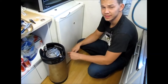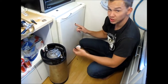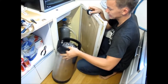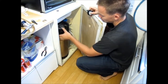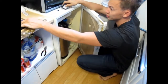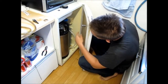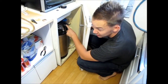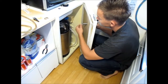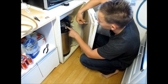Within the door you're going to remove the plastic. This example of The Bachelor has already been in service for a couple years, but I'm going to show you how to build it anyway. When choosing a place to put the shank, it's really important to open up The Bachelor, take off the plastic, and put your keg inside. Your goal is to center it up, but also consider top to bottom placement. Remember that your shank, depending on how long it is, is going to poke through on the other side. You want to place it so that it misses the top of the keg, and also misses the fin — the fin will build up ice over time. So somewhere in between there. Remember that the tailpiece, after the washer, is going to stick out even more, so you want to avoid both places.